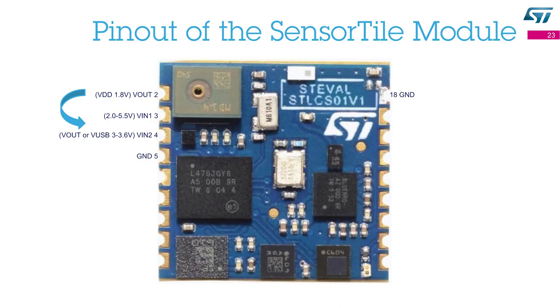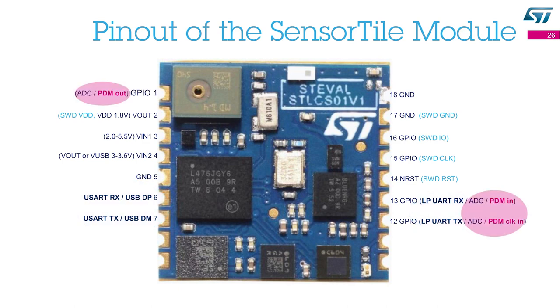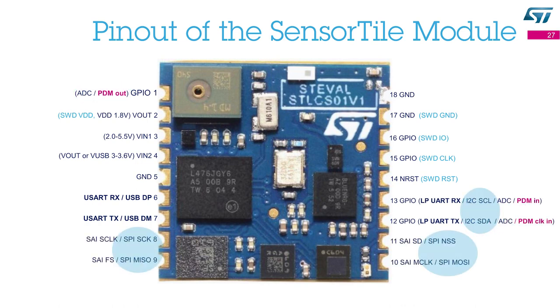Now let's have a look at the pinout of the Sensor Tile module. The first group of pins are the power supply and ground pins. The Sensor Tile can work standalone — just connect the primary input voltage pin and the ground pin to a power source. By default, the secondary input voltage is internally shorted with the primary voltage; however, one may use a different higher secondary voltage to match the host system voltage or to enable USB on-the-go. The second group of pins is dedicated to programming and debugging. The third group is dedicated to the UART or USB interfaces, including a low-power version of UART to minimize power consumption. The fourth group is dedicated to the PDM (Pulse Density Modulation) bitstream used by digital microphones; on the same pins, a 12-bit analog-to-digital converter is also available. The fifth group is dedicated to the I2C and SPI interfaces. All interfaces are available on different pins so that they can work simultaneously.